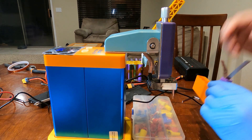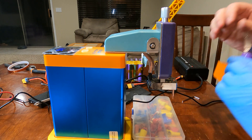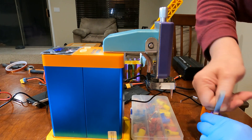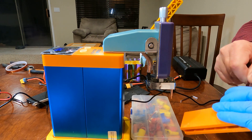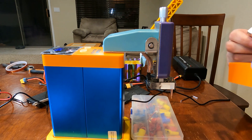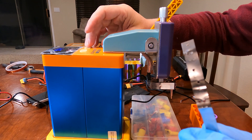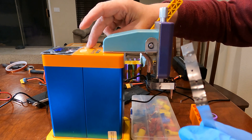That's a pretty good weld. Got a slight blow-through on one weld. Let's see — yeah, that's definitely got good strength there. There we go, got it off. Nice. And those holes are caused by a rip-through. I'm going to try to lower the T just slightly because I do have a slight blast-through on one side.